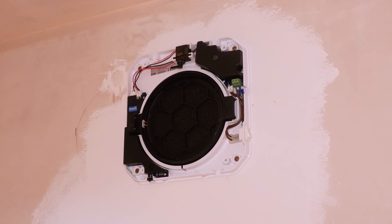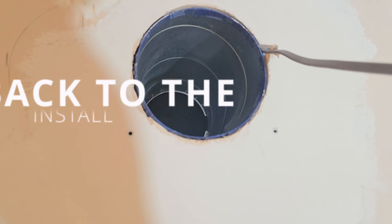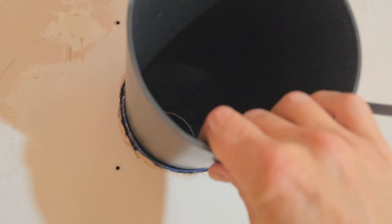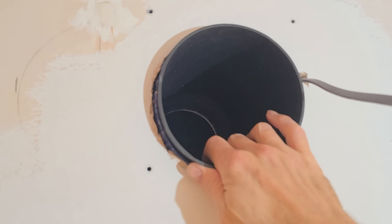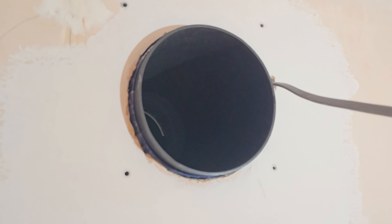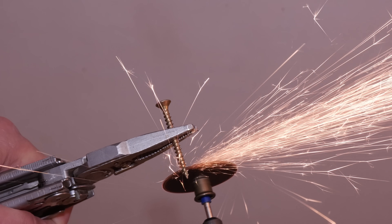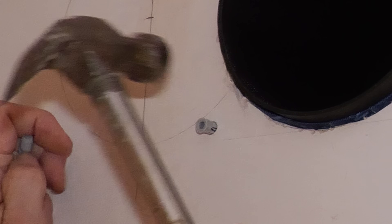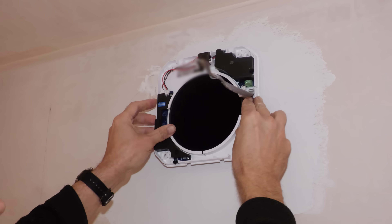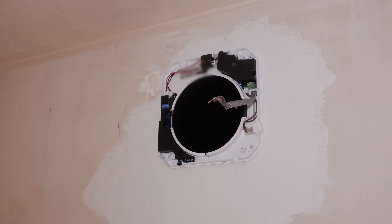The only downside in Sam's view is the Phoenix connector for mains input, which he thinks is pretty fragile — but I didn't have a problem connecting my mains, which was all wired in by my electrician. Back to the install: you do need that outer telescopic pipe as the capsule has a foam sleeve to ensure a snug fit with the pipework, so on balance I would have been better using it than my spiral ducting — but thankfully it slotted seamlessly into that ductwork. I cut down some screws to ensure they wouldn't pierce my vapour barrier and used low penetration Fischer PD8 fixings to fix the inner wall fixture part in place. This fixture part is identical to the outer wall fixture part — clever bit of manufacturing efficiency there by BSK.